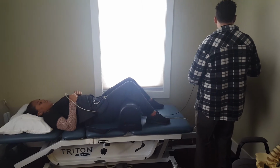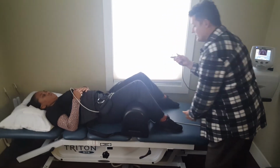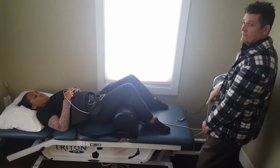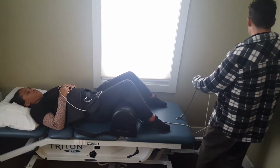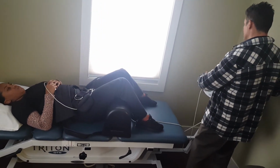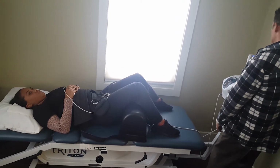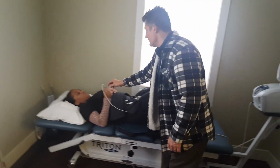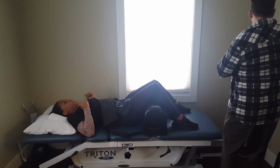So, removing the harness: I hit the rope release, I gave it some slack, I undid this. Again, if you hit that rope release, this thing can come up and hit you in the head. You don't want to do that. So grab a hold of that and then hit the rope release button, and it will allow that to go into the machine, and then you let go of the rope release and then you're good. So we will turn the machine off at this point. We'll go ahead and I'll take that from you. I'm going to set it up here.